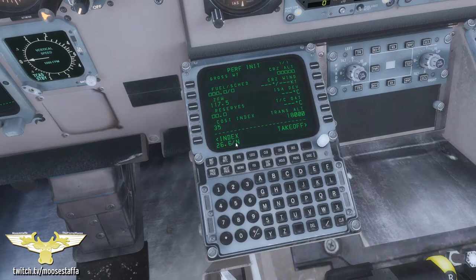Your two options are N or A. N is for normal, and A is for alternate or abnormal or whatever you want to call it. The story behind this is the MD-80 has a problem with fuel freezing or water freezing and condensing in the tanks. When operating in really cold areas with partially filled tanks or full tanks, it would start to burn out of the tanks a little bit first, just to keep skin contact down with the fuel, because normally it'll burn the center tank out first and then the wing tanks, and the wing tanks will just be sitting there getting colder and colder and colder. So putting the A in there will do that other alternate burn method. The normal will burn the center first and then burn the wings in tandem. So unless you're operating up in Moscow somewhere in the Russian winter, or in the northeast in the middle of winter, you're always going to use N for normal. And when in doubt, just use N for normal.